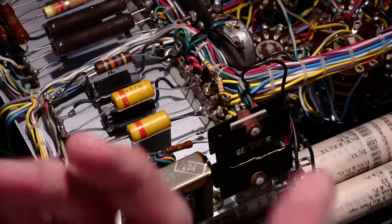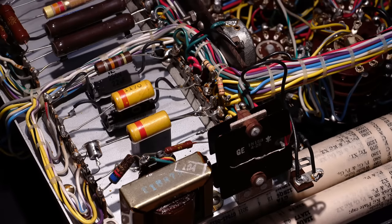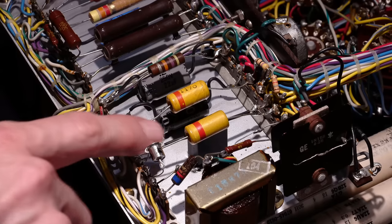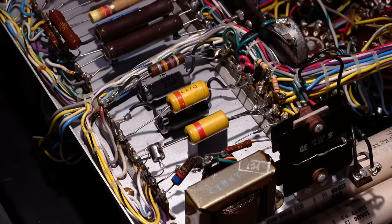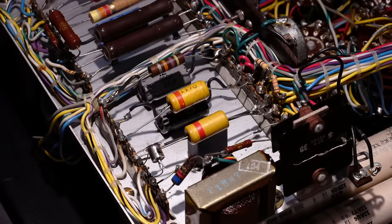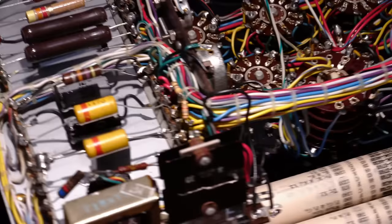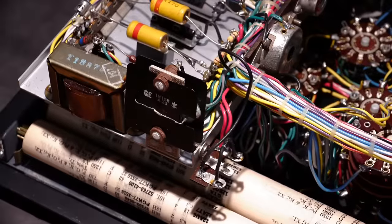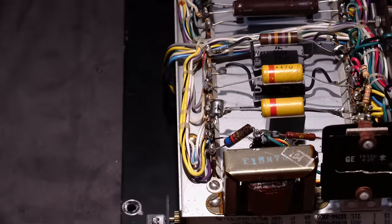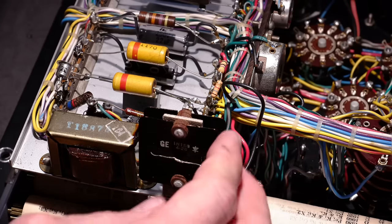Whoever worked on this has opened up one end of a diode and tested it; it was left in circuit, so obviously it works. For those who haven't seen these old diodes — they look like wax capacitors with a little cardboard tube and a red band denoting the cathode end. Quite a bit of drop across these. I see another diode has been replaced over here, and these diodes here on little tabs look like they have a small heat sink. It's two diodes in series.